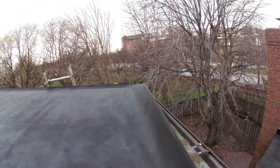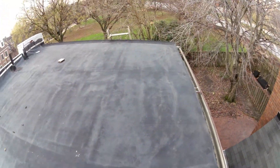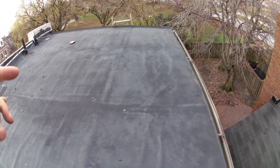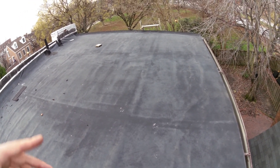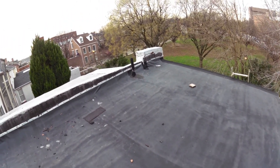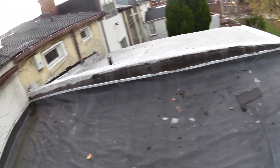It's not adhering properly, and if it's not adhering here, it's stopping right about here. It seems like the glue is starting to hold, but I can't imagine that it's holding as strong as it is supposed to. You're not supposed to glue over top of a granulated substrate, so this is installed improperly.